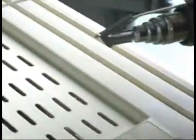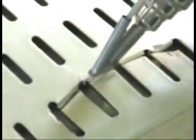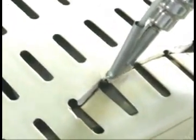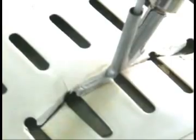To commence the welding, insert the welding rod through the feeder nozzle and slowly blend the welding rod with the surface being welded. To ensure a smooth weld, feed the welding rod into the feeder nozzle while slowly dragging the heat gun across the surface of the area being welded.